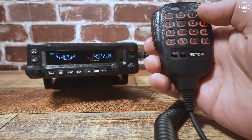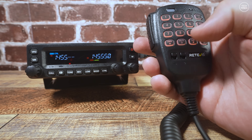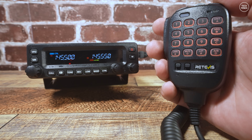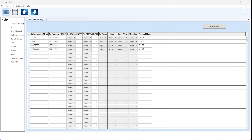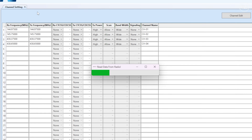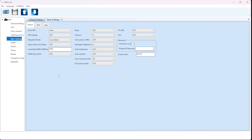As mentioned, you can direct dial frequencies using the included microphone, with each front-facing button back-illuminated for use in dark environments. To use the programming software, you need the programming cable plugged in between your computer and the radio. You can find the COM port in your device configuration, then select it within the MA1 programming software and read back the data to verify the connection. Down the left side of the software are the main selections, with the basic settings tab and channel settings tab being the most useful.